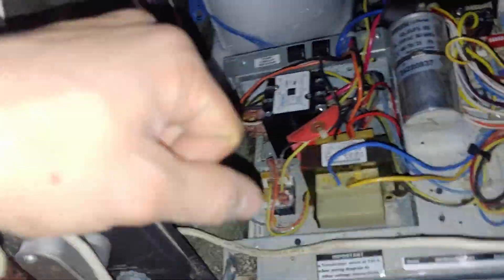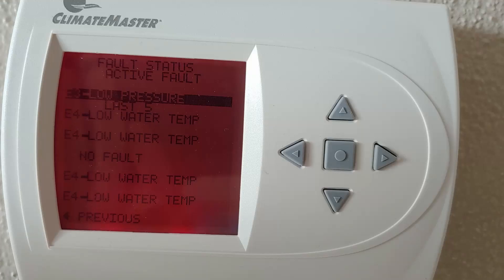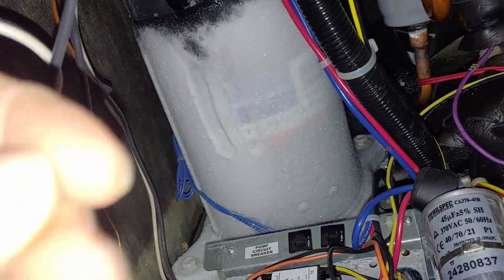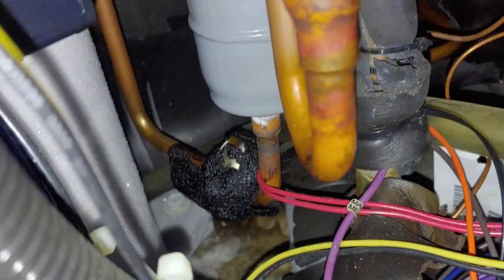We're working on a heat pump here. Symptoms were giving a couple codes on the thermostat, which I can show you. We've got definitely a low temperature situation here. That's sometimes normal to get frost on your compressor while it's in heating mode if the loop field water coming in is really cold, because you've already pulled a lot of heat from the system. The water heat exchanger back there also has some frost on it.